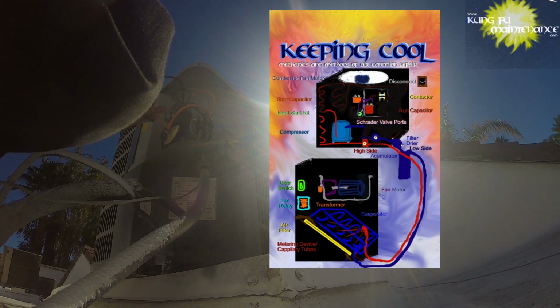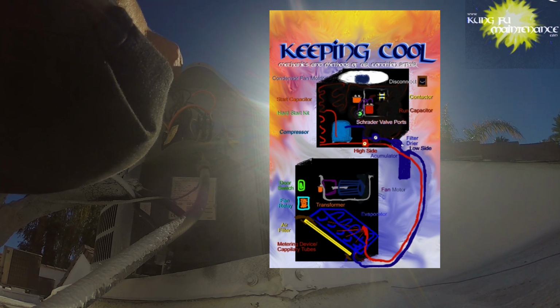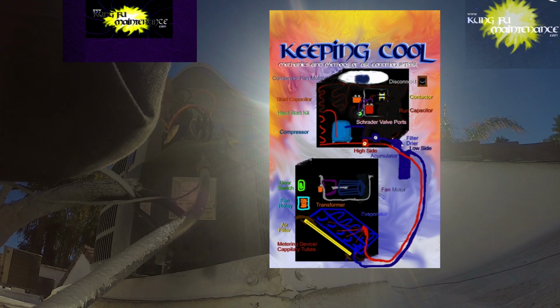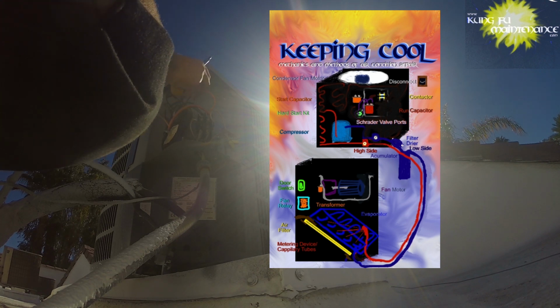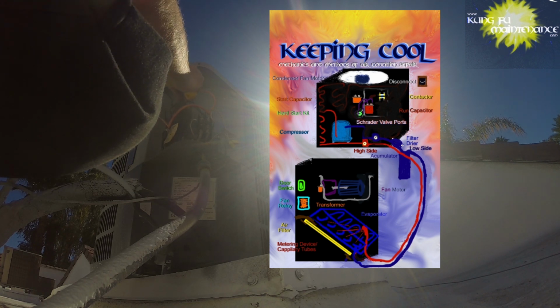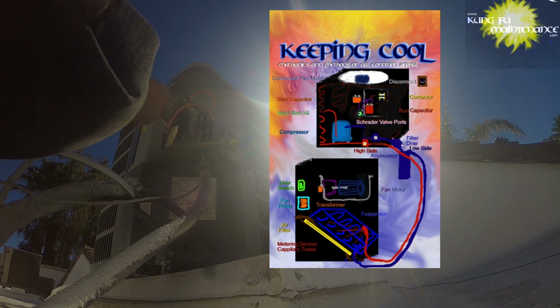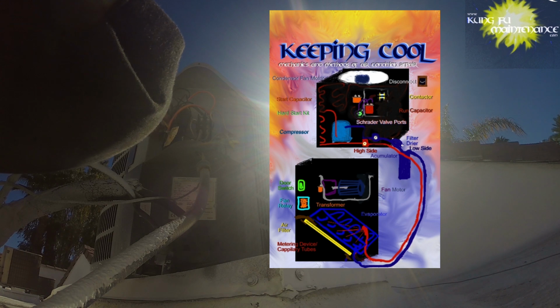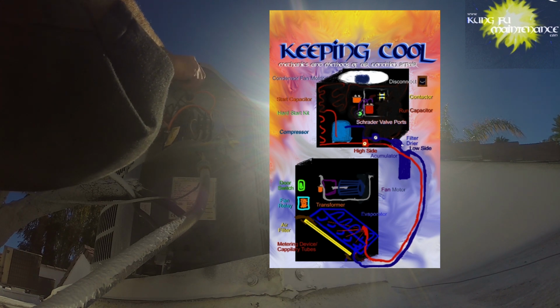Got our yellow start wire. It's all up by itself, along with the hard start kits on this one. I like using hard start kits, but I like just using one of them. You know, max is two. We got our blue and red wire for the common. And again, this one has two hard start kits on it. I'll take those off as well. Okay, and then we got our brown fan wire. It's on the side. That's it for the capacitor here.